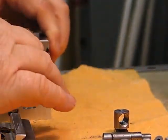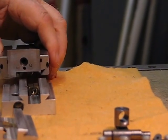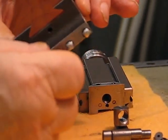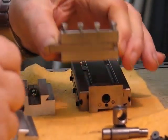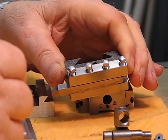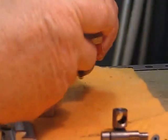That's how it sits on the base — I dropped it down here because I wanted as much material as possible. I put on this unit as a tool holder because the tool height on top of the surface of the table is now too high. So I decided to make a tool holder that would be adjustable up and down to eliminate the use of shims with different tool bits. I made a nice close fit on the dovetail.